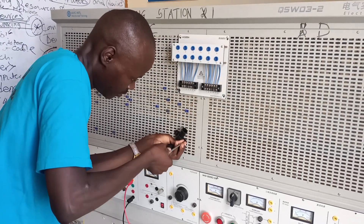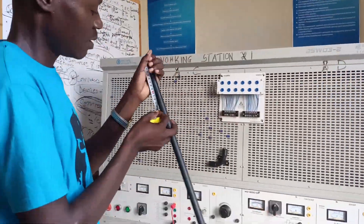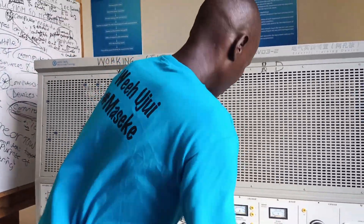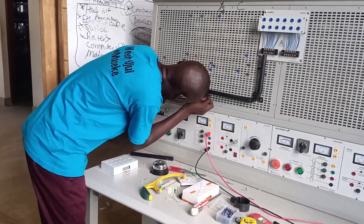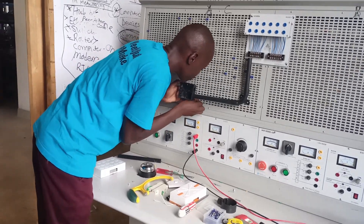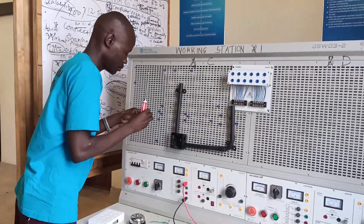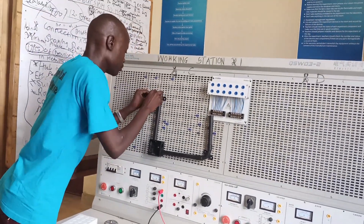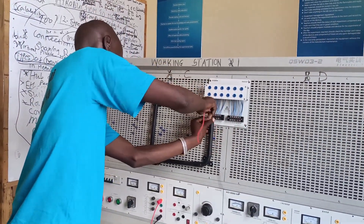For my case I won't have a consumer unit because I'm using a live training component — it has power and all that. I'll start by mounting my surface mount, doing the installation in conduits. All I need is a switch box, conduits and saddle clips for my surface mount.